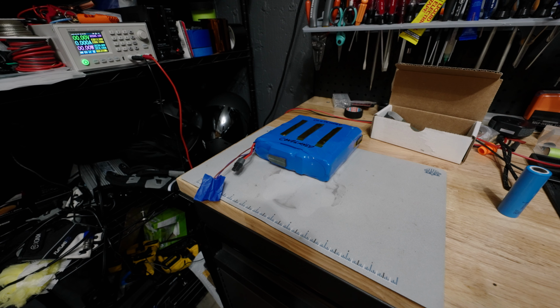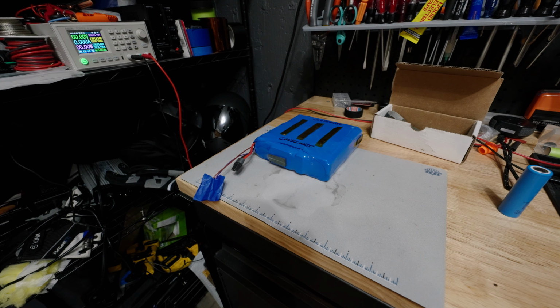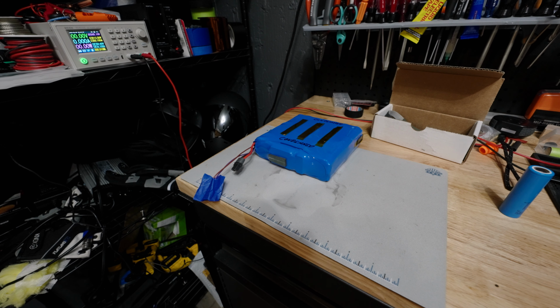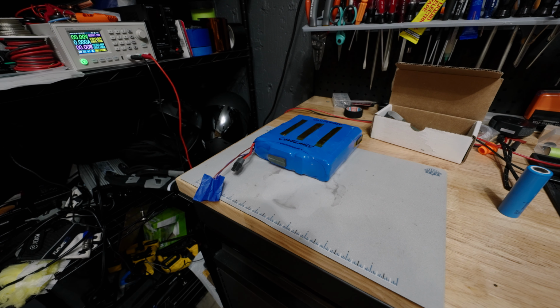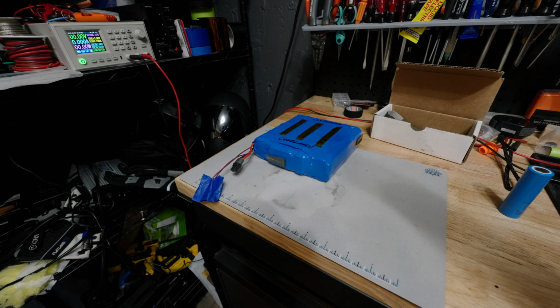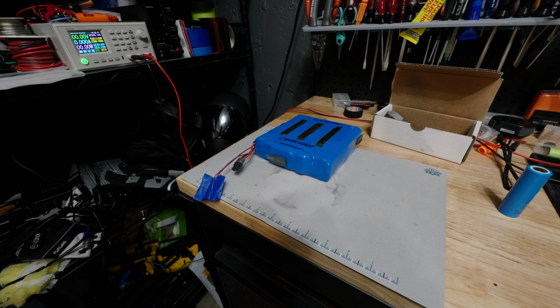Now, I was compelled to make this video after yesterday a gentleman brought in an electric unicycle to have its battery checked out, and the particulars of that situation aren't entirely relevant, but the situation itself is an unfortunately common one. The device was left on for a period of time after the battery was already very low, and so the constant slow drain of the device, or rather of the battery from the device, led to it dropping well below its empty threshold. And the behavior of any particular lithium-ion battery pack when it is drained that low can vary depending on how it's built, the cells that are used inside of it, and the way it was drained or discharged down to that point.